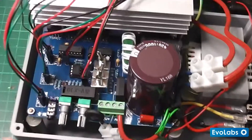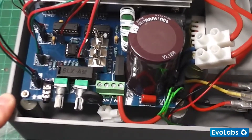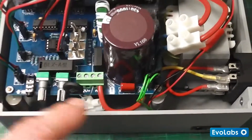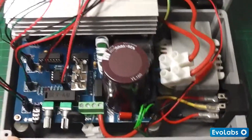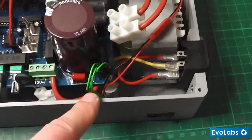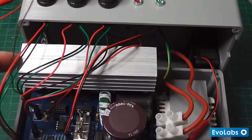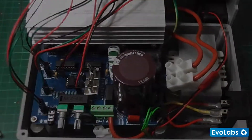Unfortunately they changed the board design to the point that the mounting holes are actually slightly narrower, so I've had to hot-glue them in on the standoffs rather than printing an entirely new case. On the back side the bolt holes are fine. Also rather disappointingly, they removed the 12 volt output for the fan, which is why I had to take output from the DC jack to go to the fan. The heatsink does get very hot in operation so I think a fan is really required.